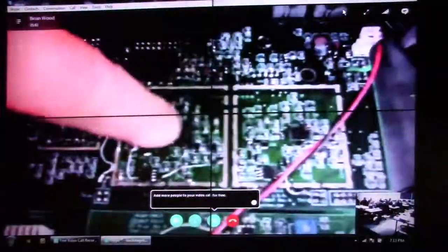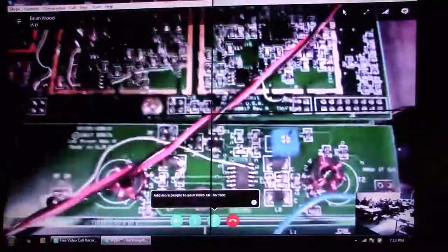The board on the end there is the synthesizer, and that was a major improvement over the original Sienna. It has two oscillator chips on it — those are 5 GHz internal direct digital synthesis phase-locked loop type devices. Ultra-low phase noise. The oscillator that drives them is a phase-locked loop that operates from a TCXO or an external source, phase-locks to that through connectors on the back, and generates extremely low phase noise.